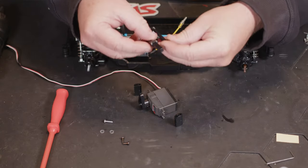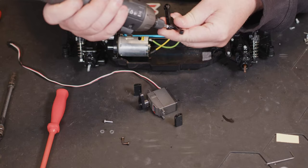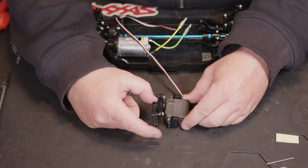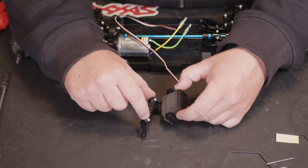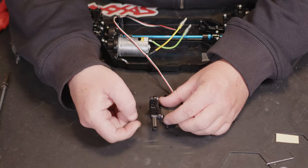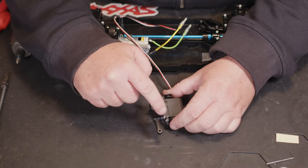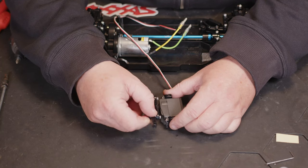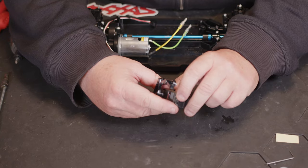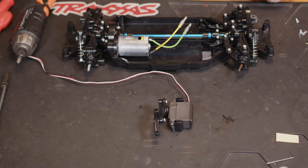You're going to want to screw this into the steering assembly. Basically this is how you want it to go together: you want your two little B11s popped into the steering bar, then you've got two silver screws both on the same side, coming through to part A5 on the outside. The whole assembly just screws in with two screws straight through the B11s - one into the servo saver, one into the actual A5 steering arm. Then you've got the two little black parts with the little curve at the top, one screw and one washer on either side. That's got our servo assembly all put together.